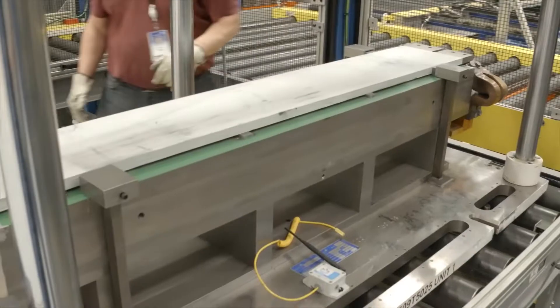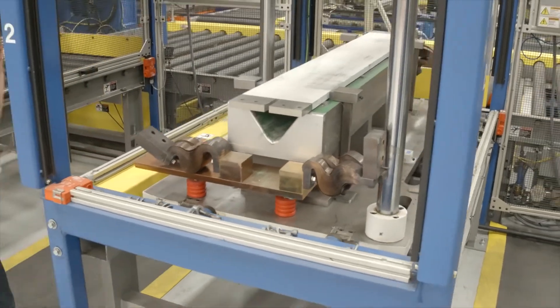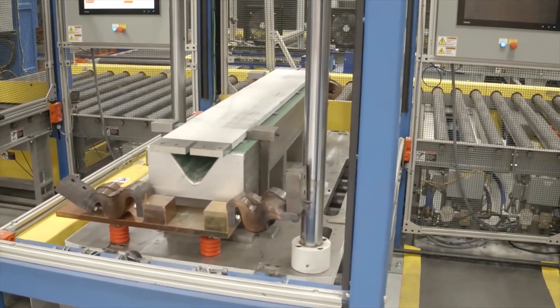There are two big benefits. The number one benefit is it's cheaper. Instead of using a large block of aluminum or titanium and then cutting a bunch of chips out and wasting them, we start with a smaller piece of the material. We form it into what we want and then it's a near net shape. The savings can be as much as 70% on the material and 50% on the machine time for these parts.